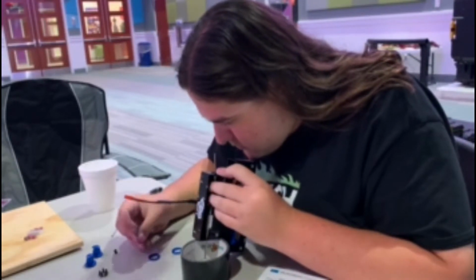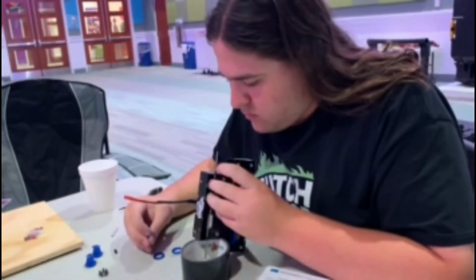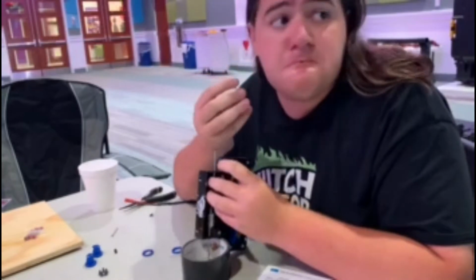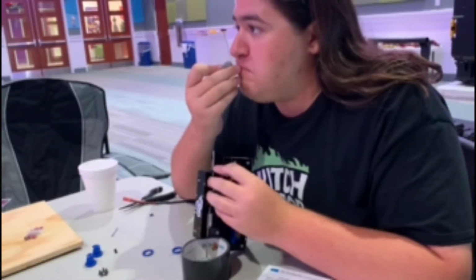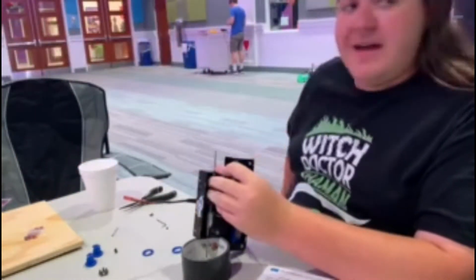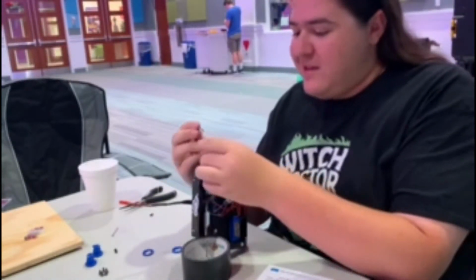While assessing the damage, I check over everything in my robot. I check to make sure my battery isn't damaged, my speed controllers, my receiver, my motors, and everything else. The big problem with the robot was that during one of the exchanges, he didn't just cut my wheel off, he cut the drive shaft off. So at this point, I have a useless motor sitting on my table, but thankfully I packed a couple of spares in case something like this did happen.